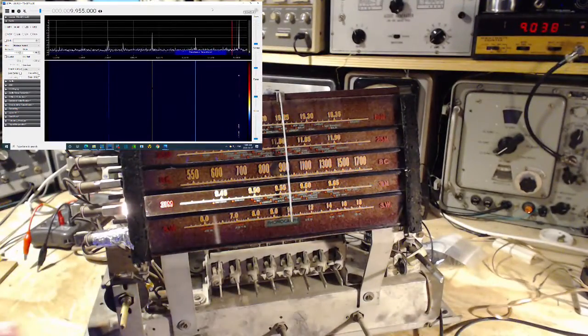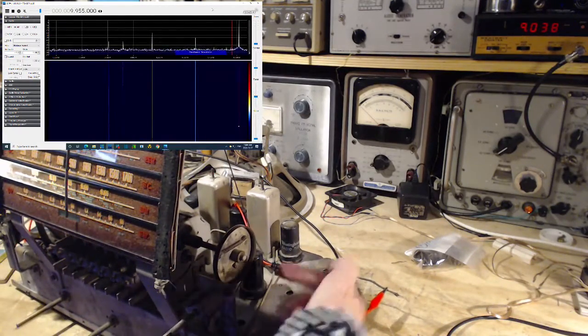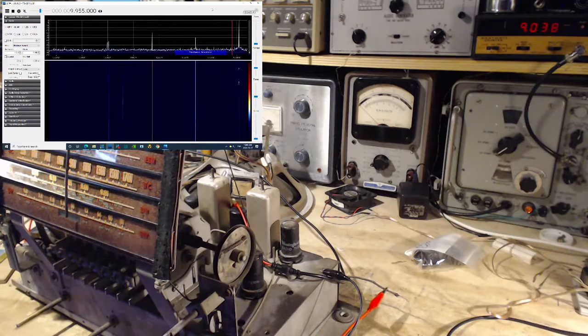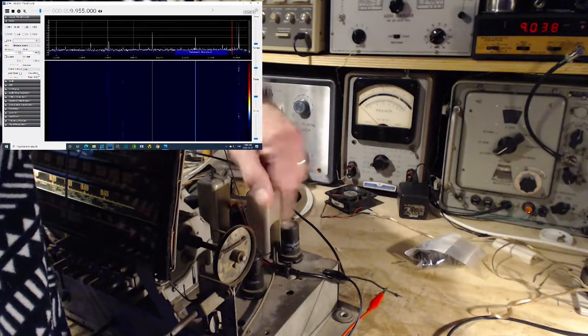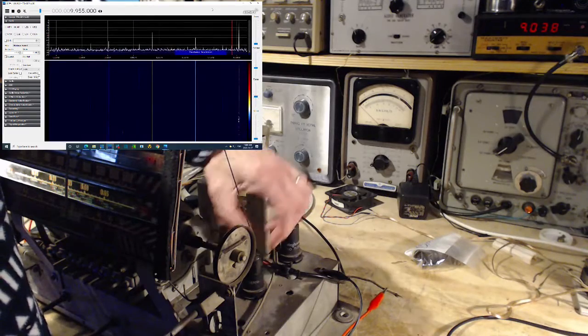That's not quite what I expect here. I've got a tube here. I just touched the tube, and I think this might explain what is wonky in the radio. Swing this around. This guy here. That's not good. So is it a pin connection in here that's bad, or is it I'm wiggling the connections underneath the radio, and there's a cold joint in there or something? That would be the question.